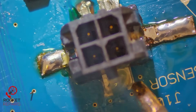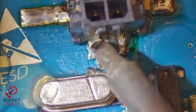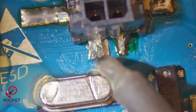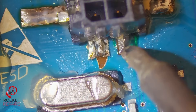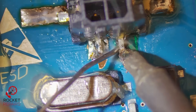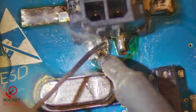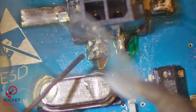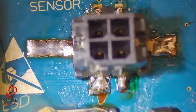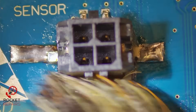These two at the back — they have a pretty solid connection already, but just apply some leaded solder. And then finally these two at the front. Connector is pushed right down to the board — you can see that. We have little remnants of glue left on it, but that's fine. Clean up where we can. One final little clean with the brush — try and move it, it's not going anywhere.